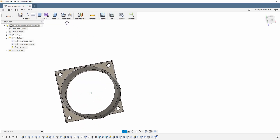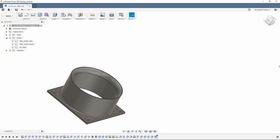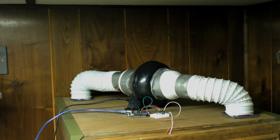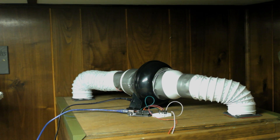I modded up a few little vent holes. You print that out and the tubing goes over that, then that goes over your hole. I had a three inch hole saw just cut out the far left and the front right of the enclosure, and then I just connect those with the inline blower and the respirator filter. So technically, ideally in a perfect world, it's taking the air through the inline filter, coming back in, and just scrubbing that same air, recirculating it in the box. So I've done some trials — let's check out some data.